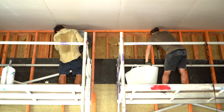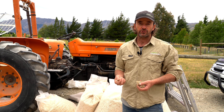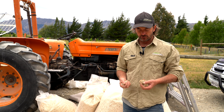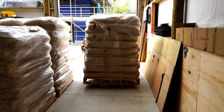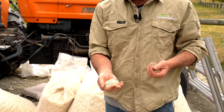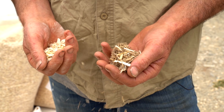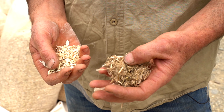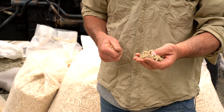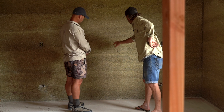We were really hoping to get the hemp from New Zealand for this job, with the new plant proposed for Christchurch. Unfortunately due to COVID-19, that plant hasn't got up and running yet, so this hemp has come from Australia. What we've got here is two types of hemp hurd: this coarse one comes from fibre production, and the one we're using on this build is from seed production — the seeds are removed and we're left with the stalk and a mixture of fibres. We love this one, it compresses really well and gives a great finish.